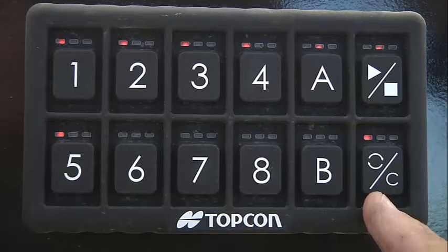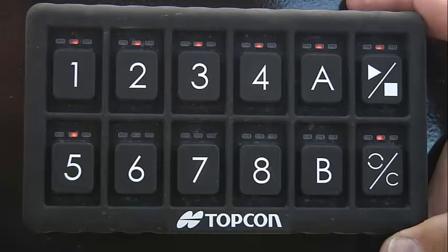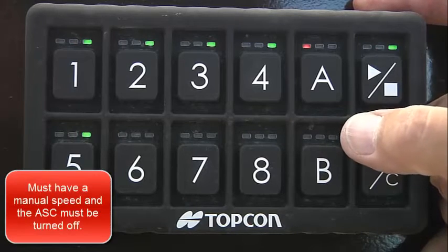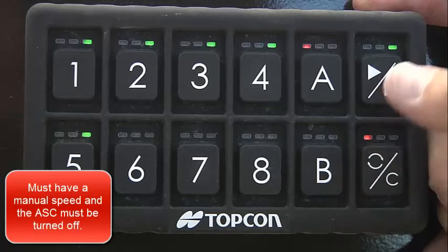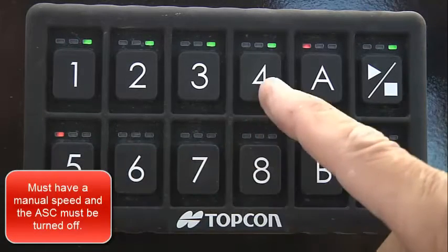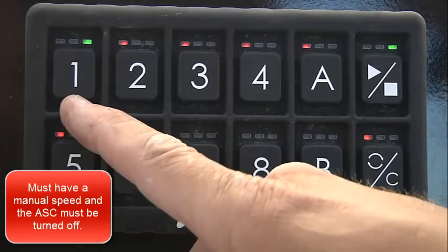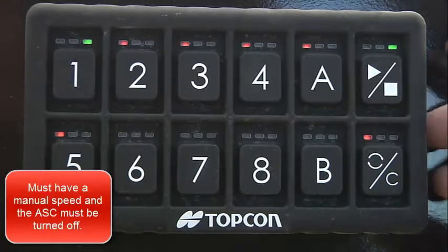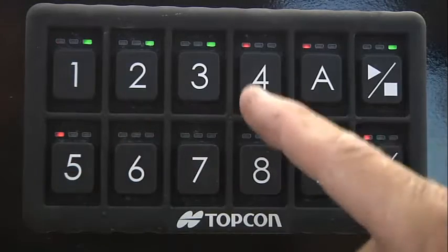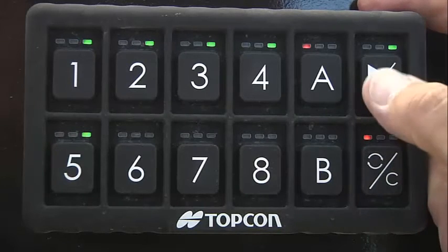We'll select all five tanks. Our fan is running. We'll hit our master and watch all of the metering augers move — RPMs will change. You'll want to turn off all but one of your tanks and confirm that each section is controlled correctly: tank one controls the first tank to the front, then go to tank two, and so on, testing all of our tanks. Then turn our master off.